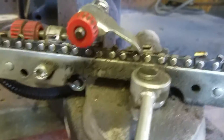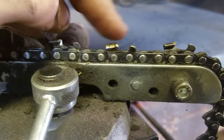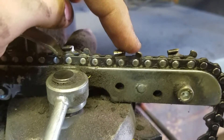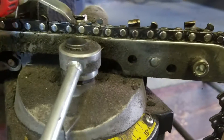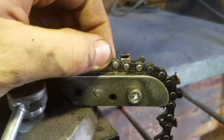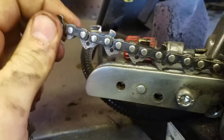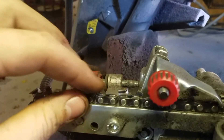What we would normally do with our second grinder over there — it's got the same wheel but it's flat and goes straight up and down — is measure the raker to the tooth, and if it was too high we'd knock all of them down to the same height. But on this one, somebody's actually done that and they've honestly taken too much off. This customer's never been here before, so I'm not even going to touch those — they don't need to be taken down anymore.